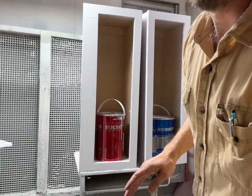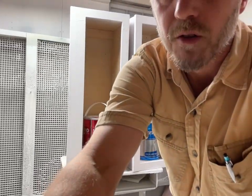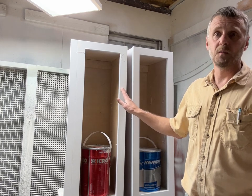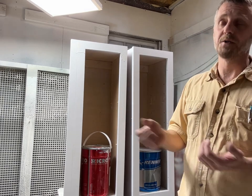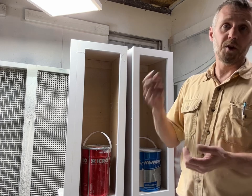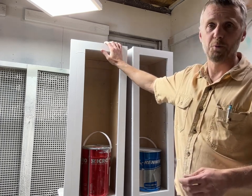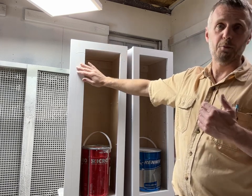Again, I'm just going to tell you, it's not necessarily that one is good or one is bad. It's just that I didn't use the product correctly. This stuff, from what I've learned, and I've only done one job, to be honest, you ought to do multiple jobs in different environments and different temperatures. Here's one thing I already found. When I came back in the shop and did this cabinet, I didn't struggle with runs like I did on the job site, until I hit this really, really hard.